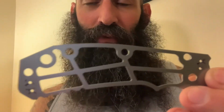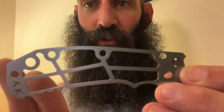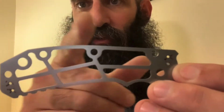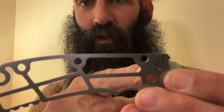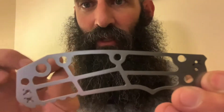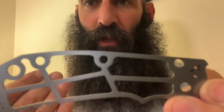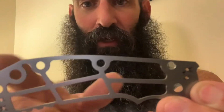But the one we have at work is an optical one, and basically you can teach it a cloud or basic size. Put it on a certain light where it lights the outside of this thing up, and it'll take a cluster of the cloud. So it took 1,800 individual positions, or dots, if you will, around the exterior of this. And then I also set up and did every individual hole the same way. So it made all these things into dots. Now, it's not an actual part, it's dots out of the CMM. You can export that CMM file and then load it into a Mastercam file, and it basically makes splines. So it's basically 1,800 positions.